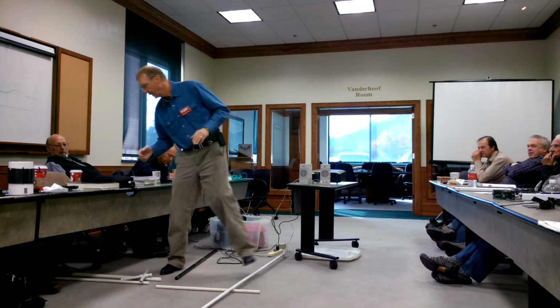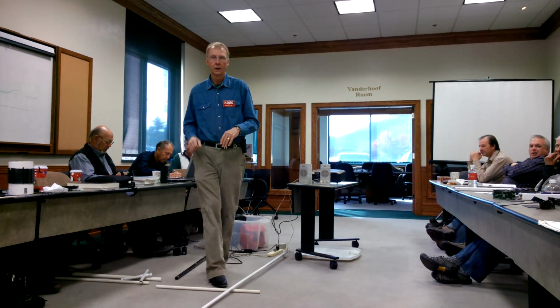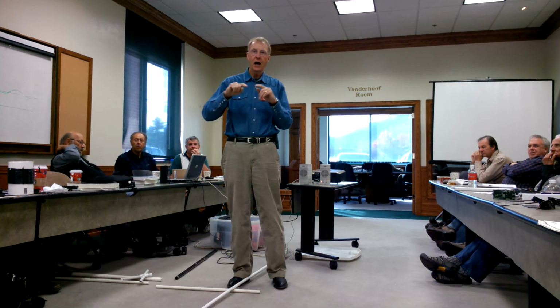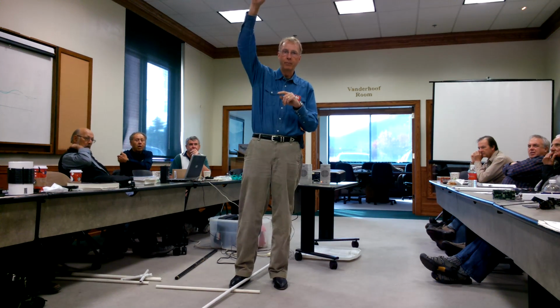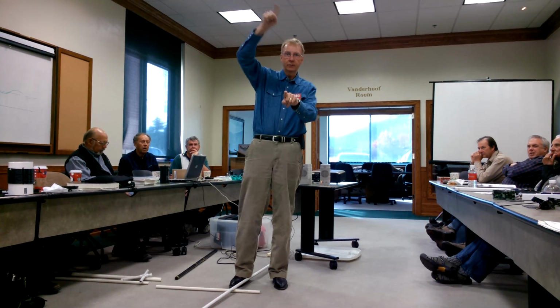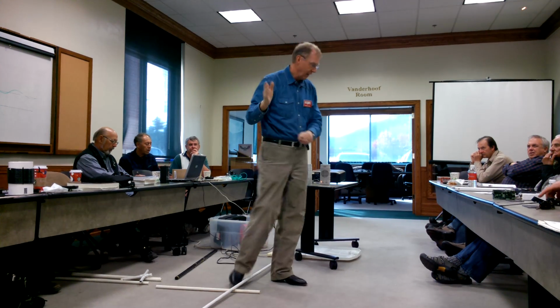So one question about using it as a vertical dipole. What advantage is that over just using a half wave vertical without a ground plane? Because if you have a half wave antenna, a vertical dipole and a half wave vertical will have exactly the same radiation pattern. The high voltage points will be, if it's 16 feet high as it is for 10 meters, the high radiation point will be 8 feet high. Okay. And that's the next antenna I'm going to show,